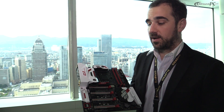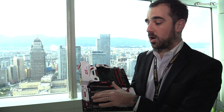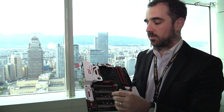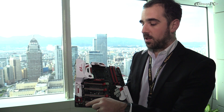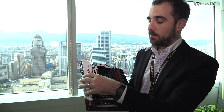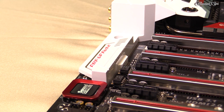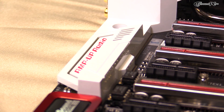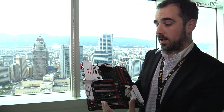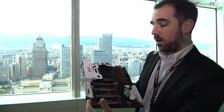Another feature we're providing for better audio is the upgradable op-amps. As you can see, we have three of them — two for the front and back audio channels for the right and left channel, and a third op-amp for the front audio port. All audio components are on a separate section of the PCB. You can see the yellow line here, which is lit by LEDs and can be customized into seven different colors. It's a physical separation in the PCB layer so that all audio components are not affected by any signals on the motherboard side.